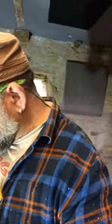We need to get some leveling compound for this floor because all that's concreted. It's a really, really hard mix and the surface has gone a bit powder. I think because I did it quite wet, which would have done no good whatsoever. So we're just going to put some leveling compound on that. And then once that's all dry, I'll seal it and put the carpet down. Yeah, I've got a carpet going in there. I've already got it, so it's one that we had rolled up somewhere. So he's a lovely boy, Sebastian.